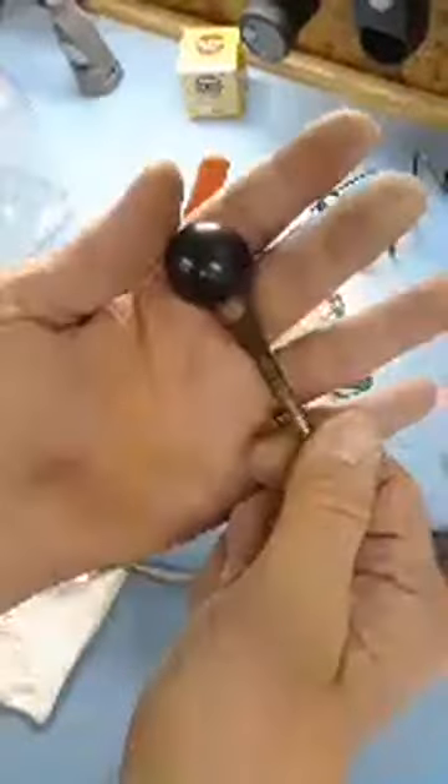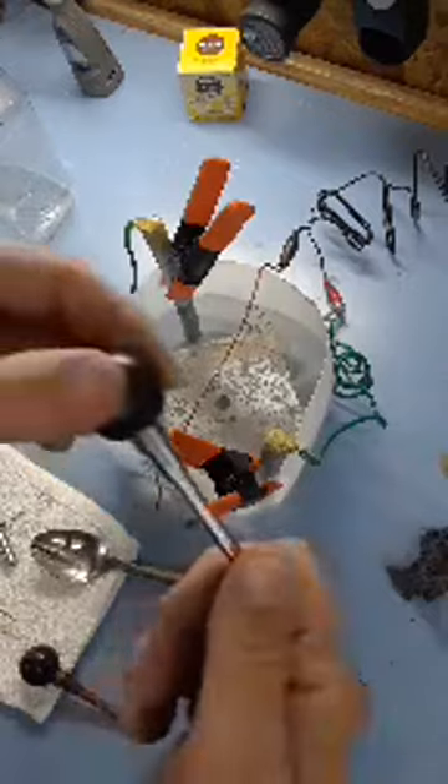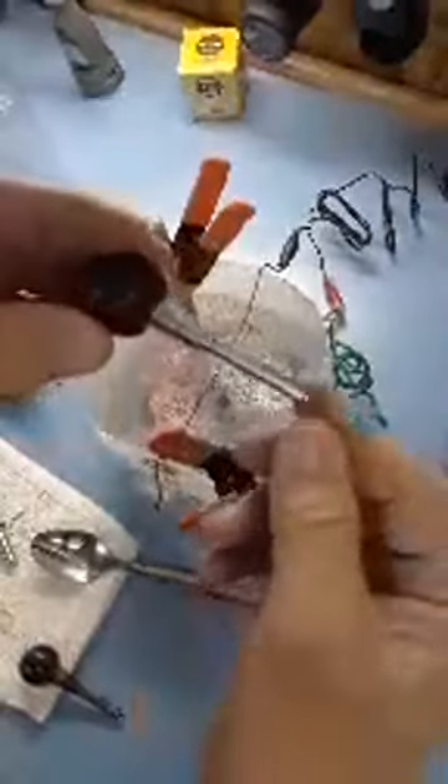What we're doing is plating some parts — just zinc plating. I've done some joysticks that look like this: hit them with a wire brush and sandblast them, then put them in for about a half hour into my zinc plater. And this is what it looks like when we're done — a nice zinc plating. These were actually down to copper underneath.